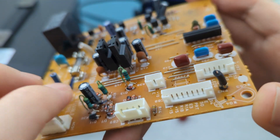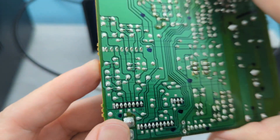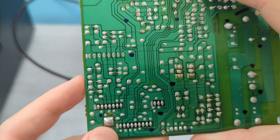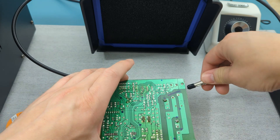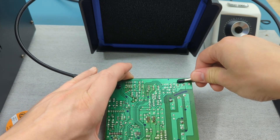I'm going to remove a resistor from this PCB, or printed circuit board. Turn on the soldering station — I set the temperature to 340 degrees Celsius. I'll attach the PCB to the third-hand soldering tool to keep it in place while soldering. I have a fume extractor fan to absorb harmful fumes while soldering.